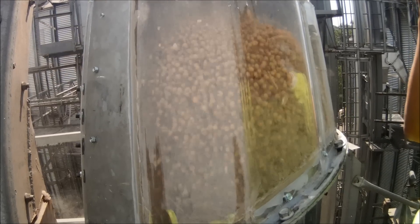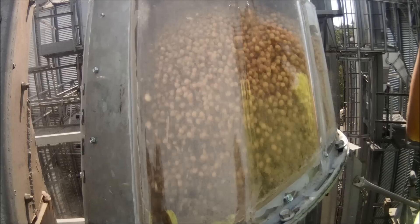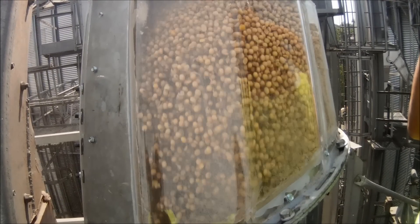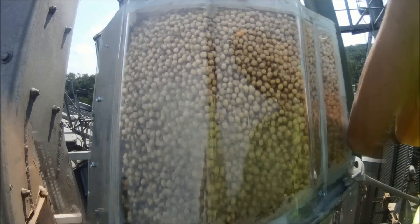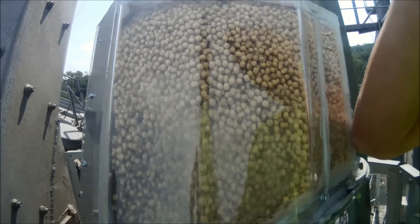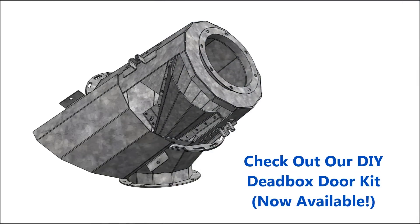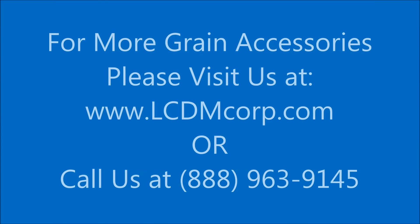Hey, Harry, that was quick. Let's slow it down. Okay, Lloyd, we can slow it. Not your voice, Harry — the video. As you can see, a pocket of grain is being formed from the incoming grain. It then overflows over the edges of the cone, and that pocket reduces the amount of damaged grain. Well, Harry, I guess our test worked. Absolutely. So go online, give us a call, check out our other products if you guys out there have any questions. Thanks for watching.